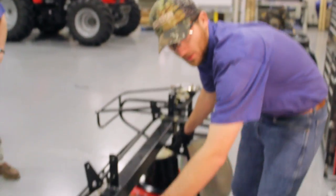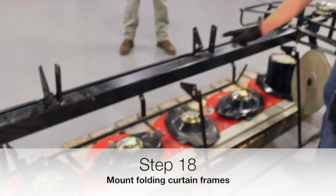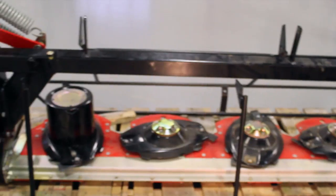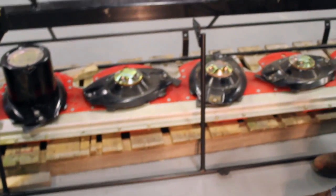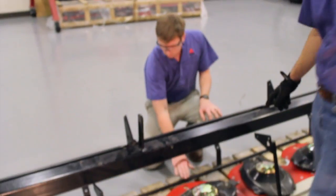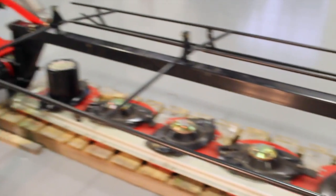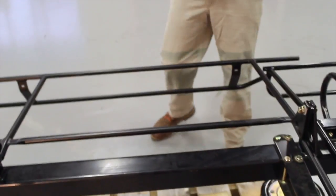We have the curtain frames laid out ready to bolt on. They will bolt on to these welded brackets right here. On each side, the curtains fold up on the front and back side to allow serviceability to both sides of the cutter bar. The bracket with the downward lip frame on front points to the front of the machine. We have now installed all of the curtain supports, which also act as a safety shield so nobody can walk into the cutter bar with the machine running.